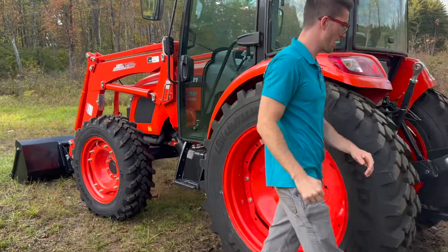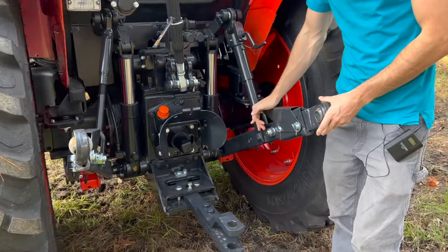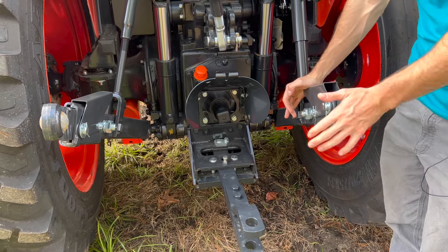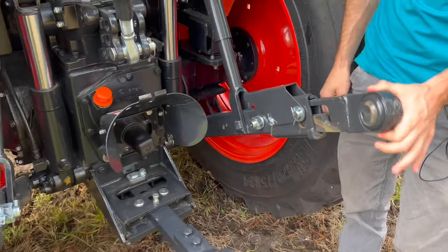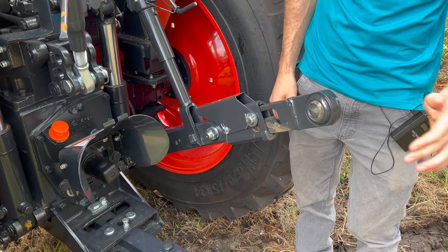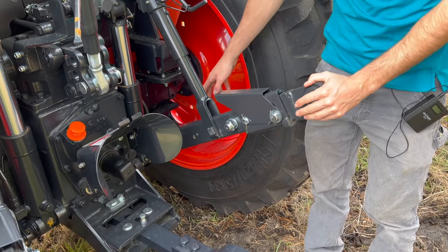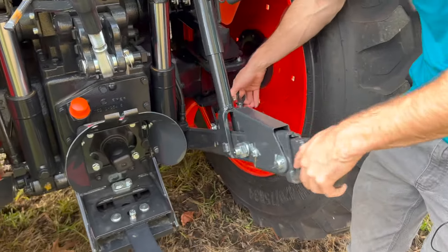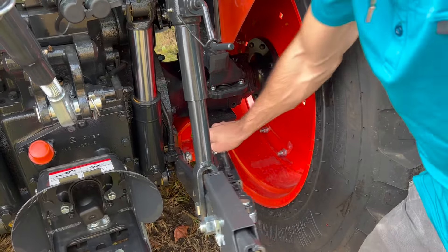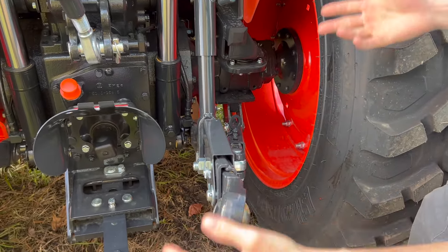So back here — it's going to be a category two three-point hitch. The three-point hitch is a telescopic system — these extend out about four to five inches, which is great. When they're out, there's also a couple inches of play. When you want to lock them back in, you back into that implement and it will lock in. Adjusting the width on these is a pull pin — you pull that pin and set it back in the hole you want. It's locked in and good to go.